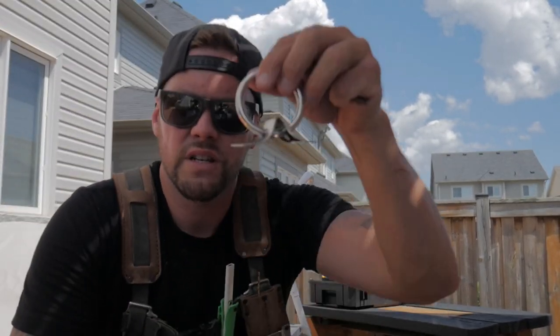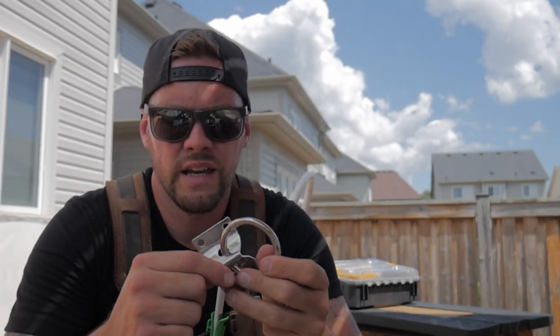So the part up there, I'm just going to use one of these little rings. It has 4 slots in it, and I'm going to put in 4 GRKs to hold the wire. That'll pull everything up, hold it plumb, and I don't have to worry about this thing falling over. I can take the braces out, and then hopefully this thing will be done.